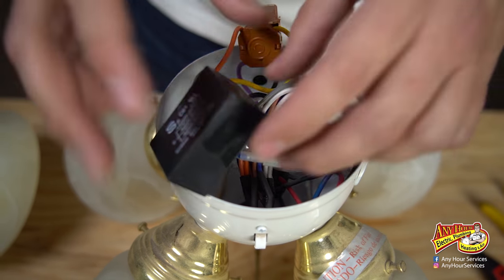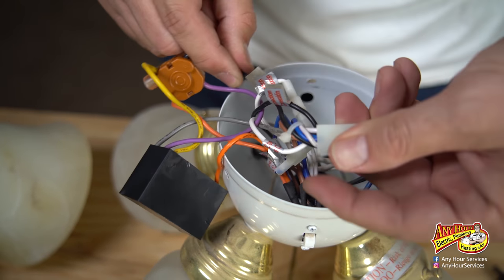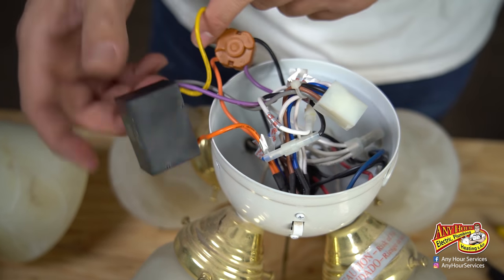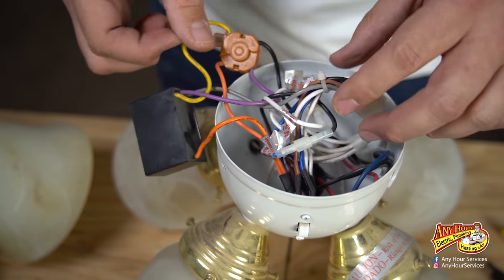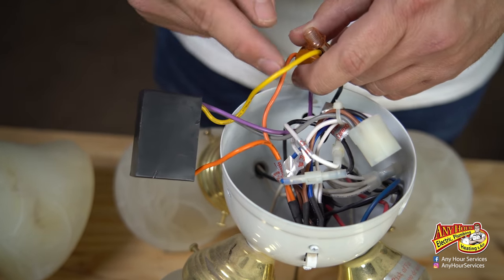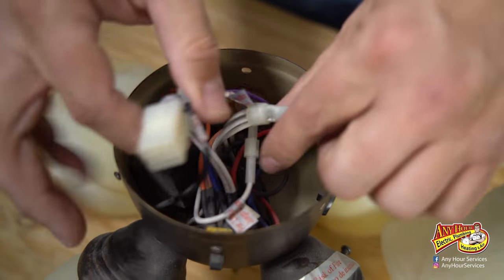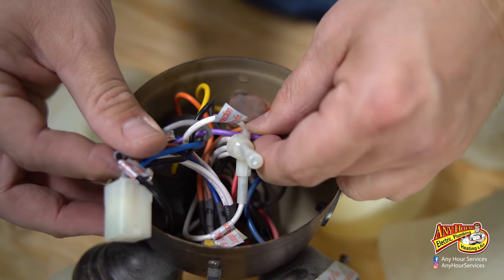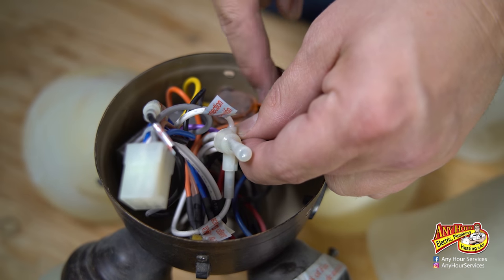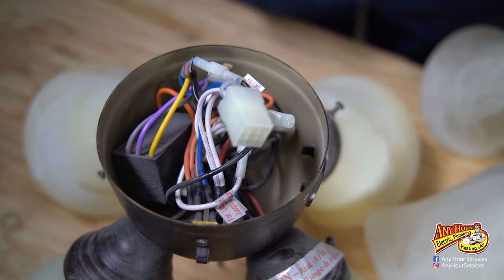The part that's going to get a little tricky is if you follow the wires off of this switch back — there's one that goes into the wiring harness, a couple go in here. So what I'm going to do is clip those off and wire nut them. If you look at the other switch, it's the exact same color configuration: purple, black, yellow, orange. So I should be able to clip them off here and make them work in the new switch.